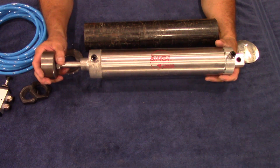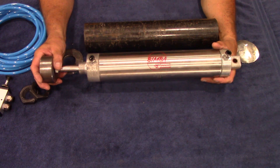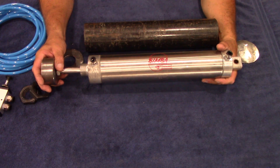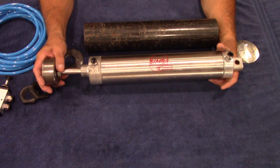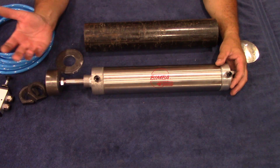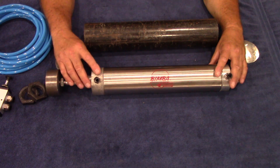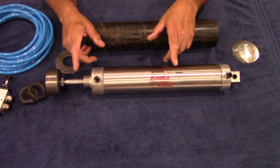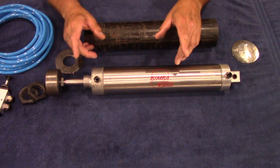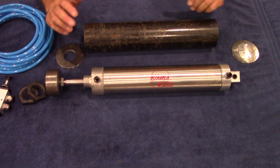A lot of people ask how strong the cylinder is. To be honest I don't know exactly, but I do know this particular cylinder can handle 250 PSI. I run my little guy and the crusher cart at 120 PSI, which is sufficient for crushing cans. If it's something really thick like a Foster's lager can I'm not sure it'll crush it. For practical purposes I use it for 12-ounce cans — soda cans, beer cans — and the bigger one handles 24-ounce cans, Arizona iced tea cans, and even aluminum beer bottles.